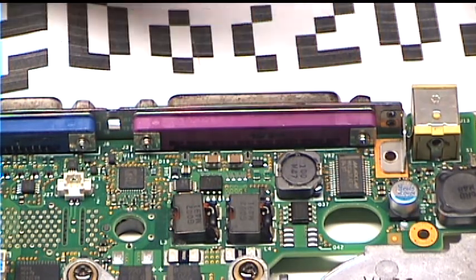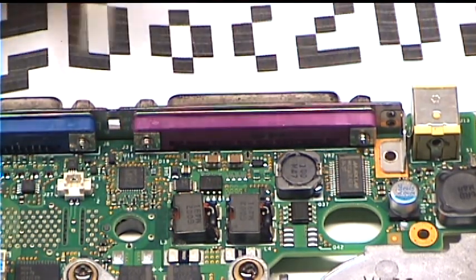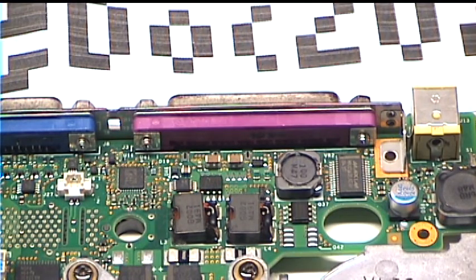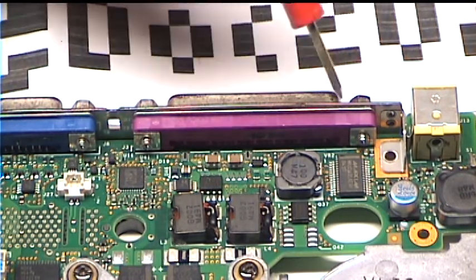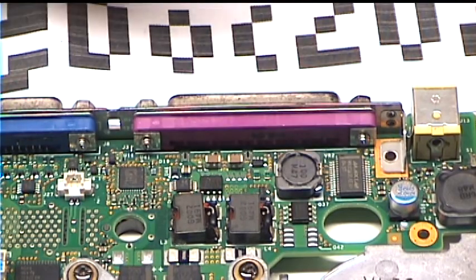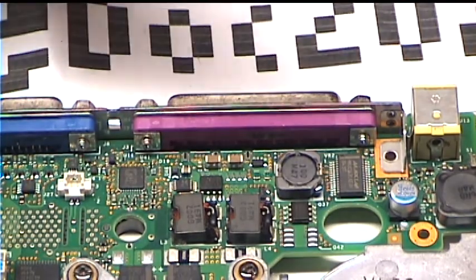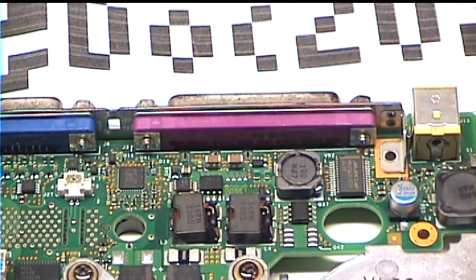And in fact, I was able to measure when power is applied, the low side driver was forced on. So there's basically no way any power is getting through. So I was thinking, okay, maybe the chip's bad. So I did a little web search on it, and now I wanted to see what a replacement would cost. I did a search on Max 1631, and I ran into something interesting, which I'll show you a picture of and link to down below.